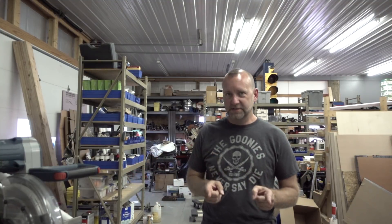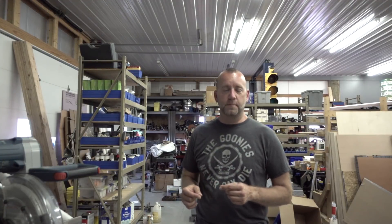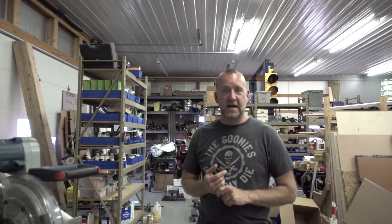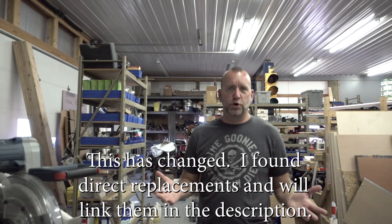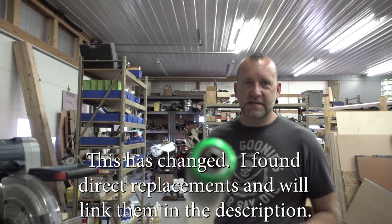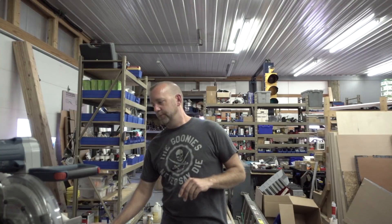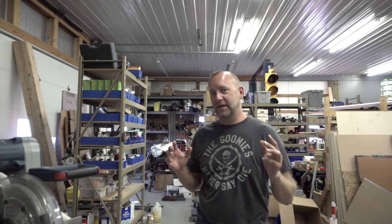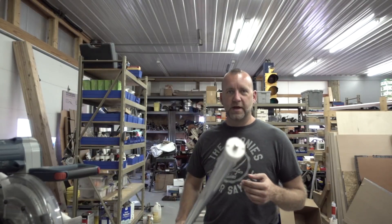To fix those, I'm going to convert over to an LED bulb. Finding an LED bulb that fits into a high output fixture is a pain and they are stupid expensive — I could not find a bulb under $100, so we are not doing that. The reason is the T12 high output has a rectangular two-pin prong on it. You can find eight-foot bulbs all day long, but they have the normal T8-style single pin on the end.